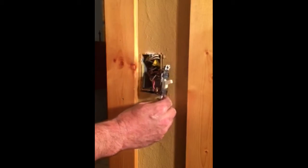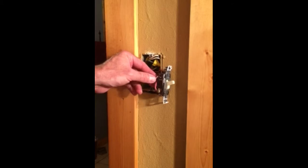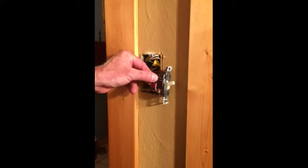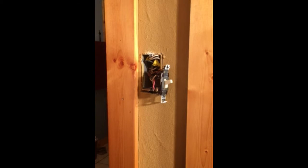Colors may vary but you usually have three different colored screw lugs. In a standard three-way switch, common is 99% of the time the black lug, but we don't know that for certain, so what we want to do is test it.